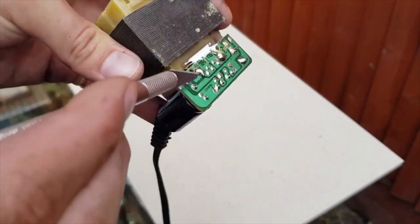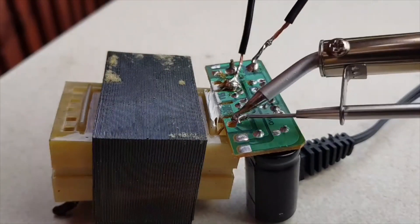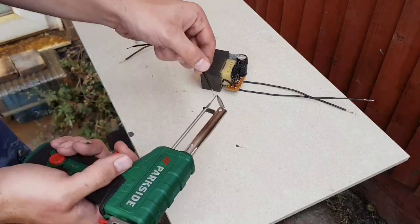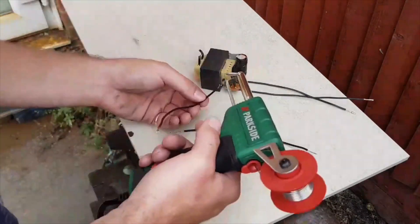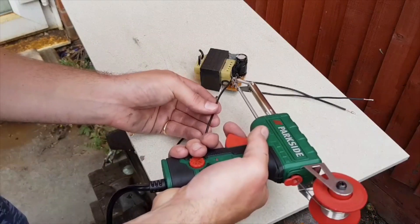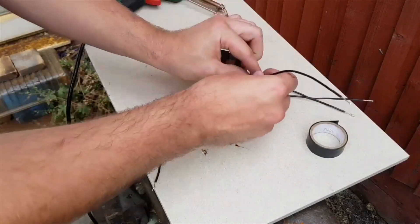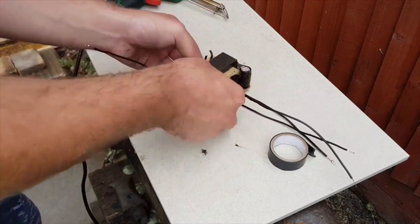The next thing we're going to want to do is solder two wires onto the transformer. There are just two obvious wires which connect from the circuit board to the transformer, and that's where we're soldering two additional wires. Having connected the two new wires, the next step is to extend the old ones. The two sets of wires we'll be left with will be the DC and the AC outlets. A useful tip if you're not particularly good at soldering: put a little bit of solder onto the wire first on either end, and then it's much easier to melt them together. I'm securing the bare wire with some electrical tape to prevent it from shorting out and make it a little bit safer.